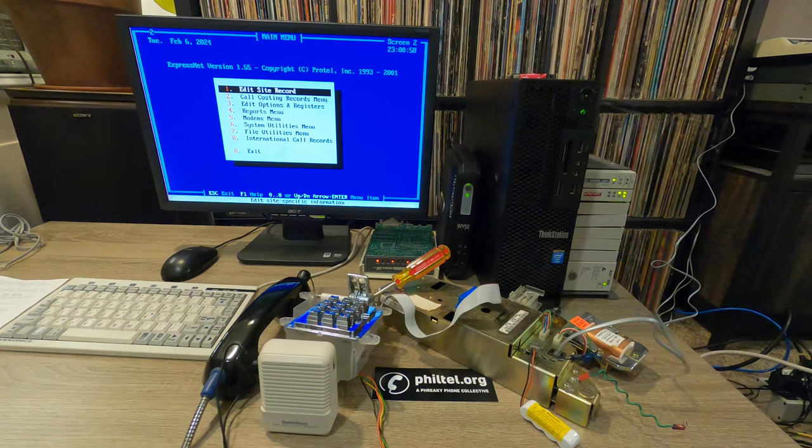And I would also probably get a full-size machine, because now that I am keeping my eye out for T-Carrier cards, if you get a whole lot of them, especially ones that are full PCI height, you're going to want a machine that's large enough to actually accommodate them. So this is good for maybe one or two half-height cards, but you could have a much bigger case and have a lot more cards in there and make it a much more worthwhile machine.